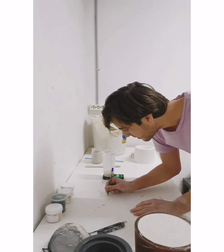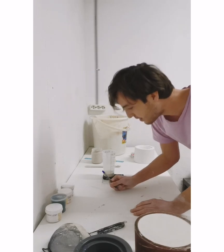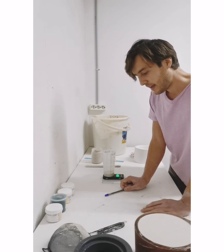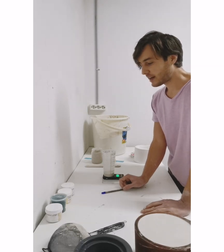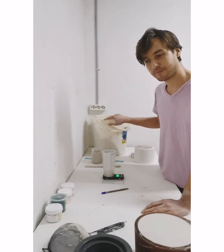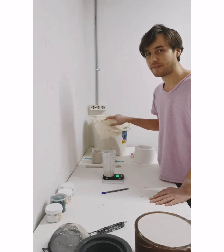So we're going to take 87 times 2, which gives us 174. That's pretty close — it's a little bit under the 175 to 180 which is what we're aiming for. So technically I would want to add a little bit more dry clay or dry casting slip into here to try to get closer to that goal of 175 to 180.